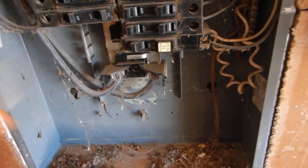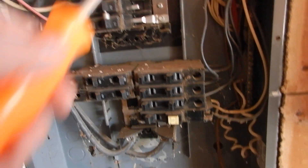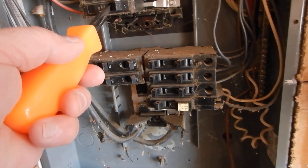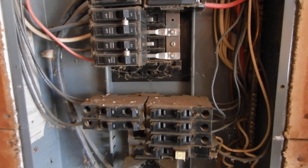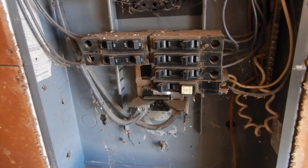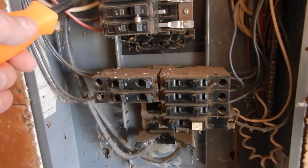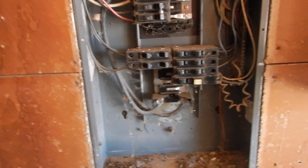We've got a 60 amp that goes down to here. So we've got 50, 30, and 50. 30 usually goes to the clothes dryer, and 50 usually goes to the oven. The furnace is on a 110 down here somewhere. So that is the condensing unit — it is overfused. It's possible it's underfused. Take your pick. It's impossible for it to be properly fused.